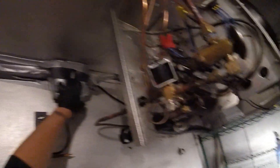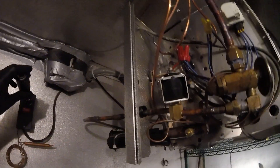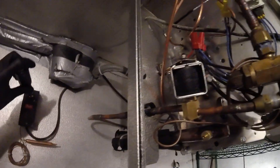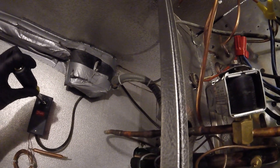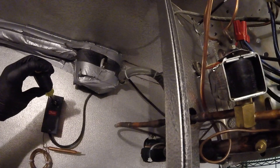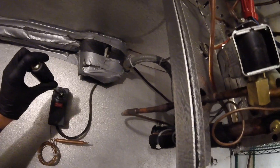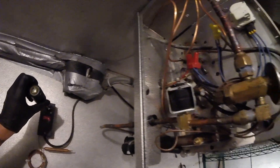Vacuum is pulled. Got the thermostatic expansion valve — the bulb is mounted on the suction line firmly. If I turn on the power, the fan should start. Now we got two fans when the thermostat calls. Let's see if our solenoid engages and disengages. Right there — you heard it. Turned on. Engaged, disengaged. Engaged, disengaged.